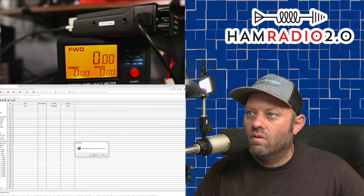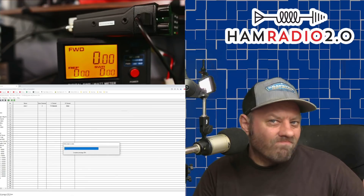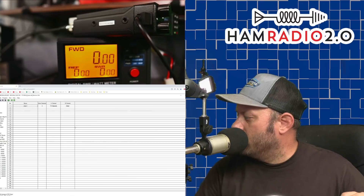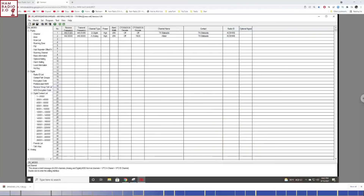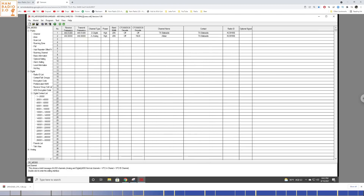Just go ahead and write to radio. We won't have any contact lists, but for the purposes of this video I don't really care. Now for whatever reason, when I changed these default channels, this checkbox for PTT Prohibit was checked and I didn't notice that. So I wrote it to the radio and tried to key up and it wouldn't let me on both channels. Why they would put that on default channels is beyond me. I just unchecked both the boxes and rewrote it to the radio.